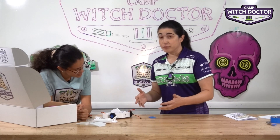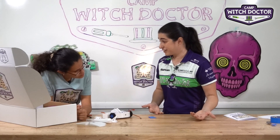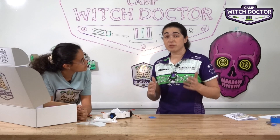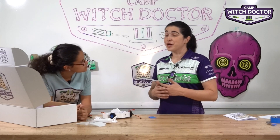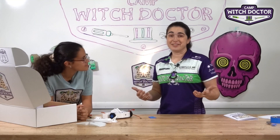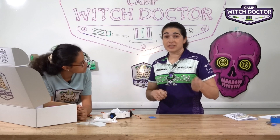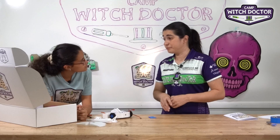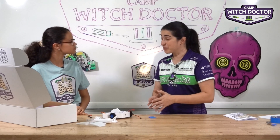For wiring the rest of the robot, we're basically going to connect all the red wires to red and all the black wires to black. You never want to connect a red wire to a black wire — that's going to be what we call a short circuit and your battery is going to be really unhappy. You've probably seen some battery fires on BattleBots. We use very energy-dense batteries. Your robot is not likely to catch on fire, but if you do short circuit it by connecting red to black, it's very likely your batteries are going to heat up and you'll probably damage them. So red to red, black to black — no exceptions on this robot.